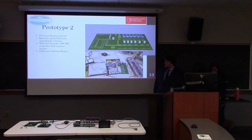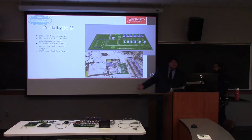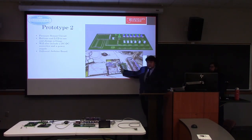After that, we moved to making the second prototype. One of the big key features was the pressure sensor circuit. As mentioned, it had to fire based on differential pressure. We used a 4 to 20 milliamp pressure sensor across a series of resistors so that our microcontroller could read the voltage from the sensor and convert it to a pressure. We also added an onboard button interface — an LCD screen and buttons — allowing us to change the board settings and firing modes. We started using an Arduino Mega instead of an Arduino Uno because it has more GPIO to accommodate all the needs.